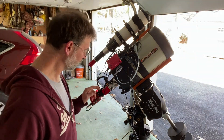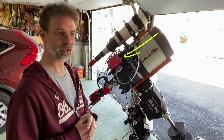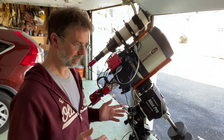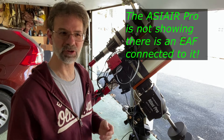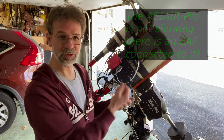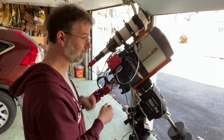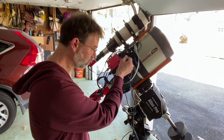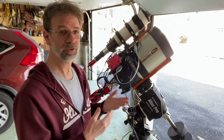Next, I've been having an intermittent problem for the last couple of months with my EAF and the ASI Air Pro. What's been happening is when I go out there and turn everything on, the EAF is not registered — it's not seeing it. It just says 'none,' and it won't see it. So what I've done is unplugged and plugged in the USB cable, and then it sees it sometimes. When I unplug it, I can hear it make a ding-dong noise — it knows it was there and it's gone — but when I plug it back in, sometimes it'll register and other times it won't.